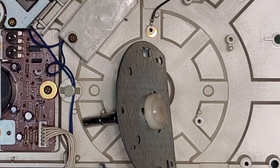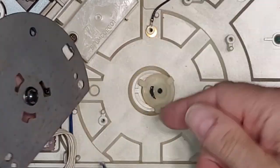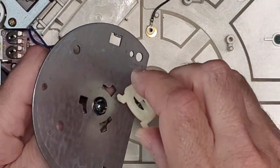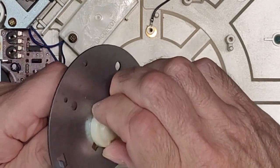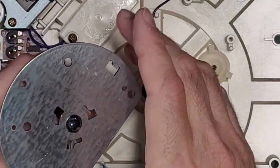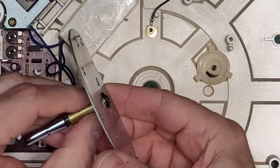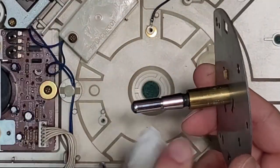Okay, a little brain fart here. The spindle is not connected to any, well, now you see what I did there. Just remove this cap. Sorry, it's early in the morning here. Just remove the cap. That's the bottom for the spindle. And then, yeah, spinning on this will do nothing. All you're going to do is make marks on there. You do not want to crush this.